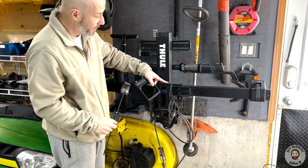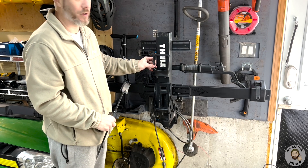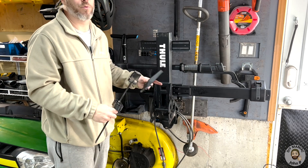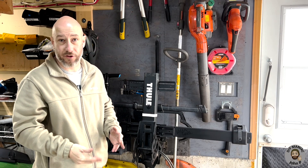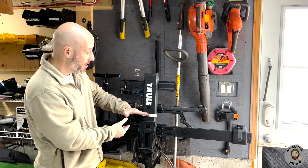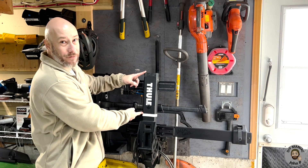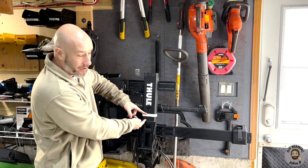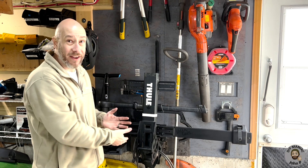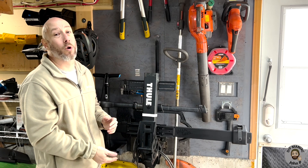I decided I'm going to be cutting it quite low - coming up about two inches from the main carrier weld, so the handle would be sitting like that. I'm going to be taking off a good amount of metal from this bike rack bringing the handle down. The old saying measure twice cut once could not be more true - measure 100 times, cut once. What I did is I used white tape and measured down to where I wanted to bring my handle. I'm removing 11 and a quarter inches of length from the center carrier section. This allows enough extra metal for the handle to comfortably slide over and have a nice finished look.